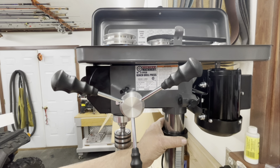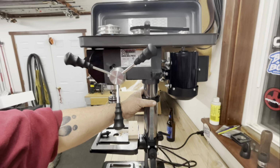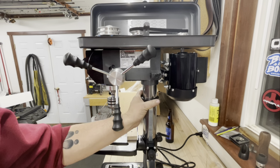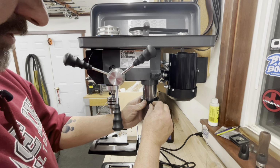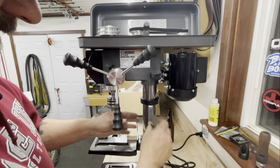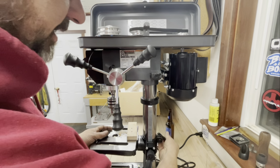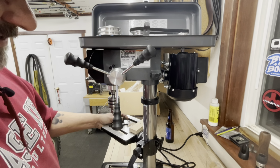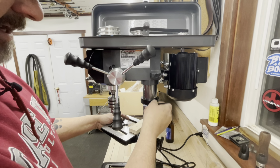One thing I've noticed too is that this little doohickey thing here they've got, that's used to hold the track in place so you can run it up and down. You can't have this thing too tight. I've actually kept it a little loose. They give you this cheap made in India Allen wrench here. You don't want this thing too tight down on here, because then when you go to rotate this table, it's going to hang up on you, and you're not going to get full span of travel out of this thing. So don't throw away your cheap India-made Allen wrench here.